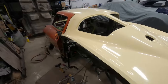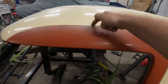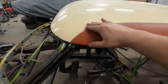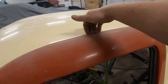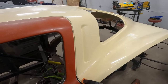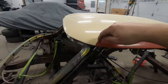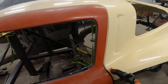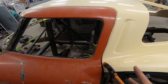But man, look at this thing — this is going to be a good-looking car. The door actually won't fully close just because there's a little bit of flashing in some areas and really no bonding strips. But you can tell that the door opening looks good. Our height is looking pretty close in some areas; the roof's a little low here but it's still very workable and in the right realm. What this tells me is if this moves forward a little bit, we'll gain just a little bit of a gap in here and close the gaps up back here. The door is pretty much where it needs to live.